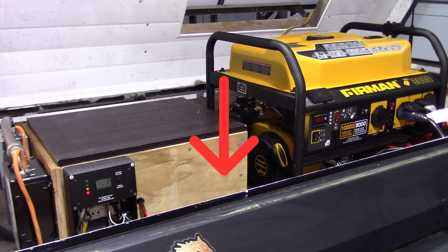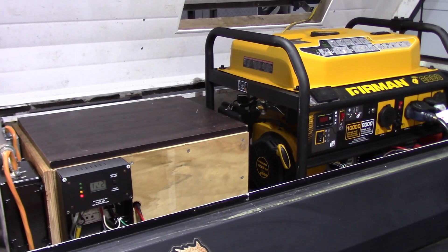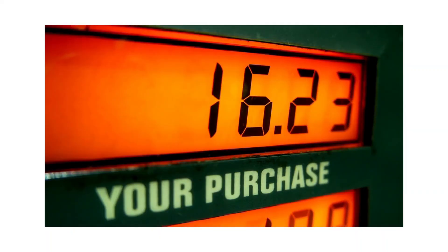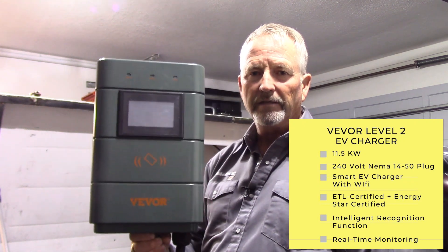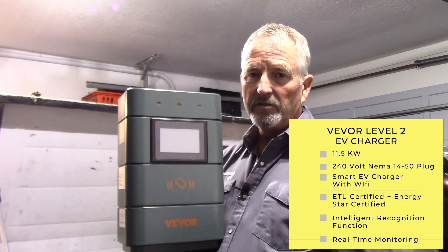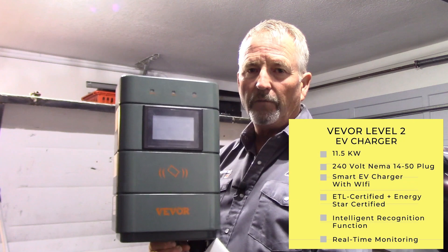In this video I'm going to add a Level 2 EV charger that can quickly get your EV back up on the road when needed. Let's get started with this simple installation. I have a space here to mount the unit and it will simply plug into the provided 14-50R outlet on the generator, providing 40 amp peak and 33 amps continuous power at the 240 volt supply to power the Vivore EV charge station — all mounted in this little utility trailer so you can bring the power to wherever it's needed. And once completed, we're going to do some testing with an EV to see how efficient the system works and how much gasoline it takes to get you back on the road.